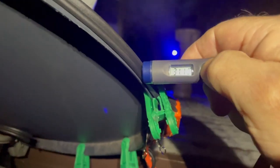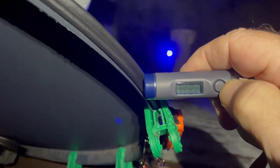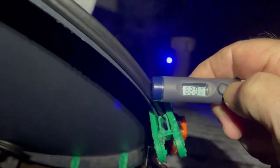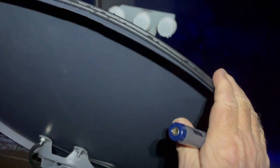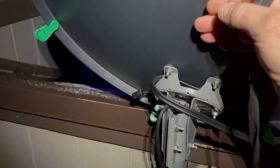I'm pleased with that, that it's doing that well. The heat tape itself is reading 62 degrees — it's warm to touch, not cold. I've got it all the way around the circumference and then the excess comes in around the housing, so it's definitely warmer than the ambient by quite a bit.